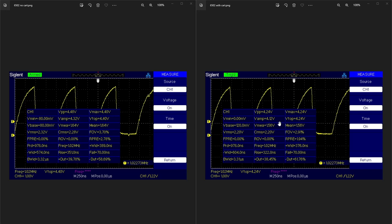I did the same kind of testing where I added and removed the 6581, the 6526s — both of them — and the 6502 processors just aren't able to keep up with the necessary power requirement for the clock output. One of those chips — even that low power UMC chip — when I put my probe directly on pin 39 to take a look, the computer actually stopped running and the cursor started doing weird things. That tells me I no longer had enough amplitude to properly drive the one megahertz clock into the 6526 chip, which is responsible for running the cursor and the IO.